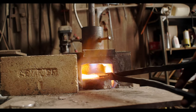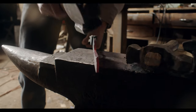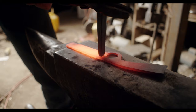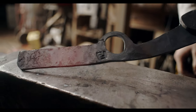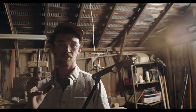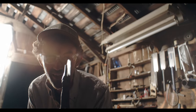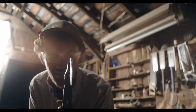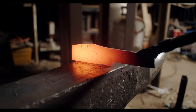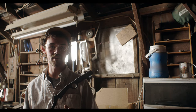I'm going to do one or two heats, get this handle pulled down a little bit here, and then we can go on to grinding. At this point I'm done forging — I'm going to stamp it with my touch mark, then make it nice and straight and do a little normalizing to begin the heat treating process. Normalizing just shrinks down that grain structure of the steel and gets it ready for the quench. I'm going to work these little kinks out and get this nice and straight going into the normalizing process. This is the progress from tonight on this nut cutter: got it forged out to shape and straightened. When we revisit I'll normalize it, grind it, and then quench it.